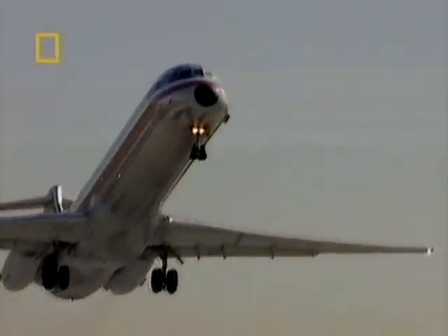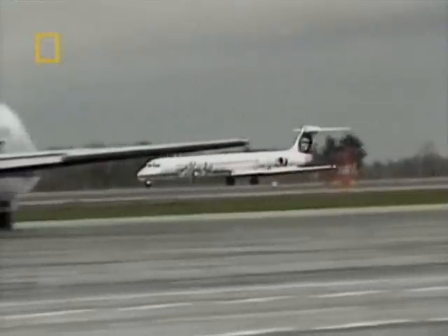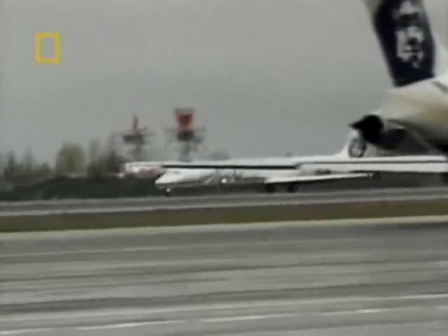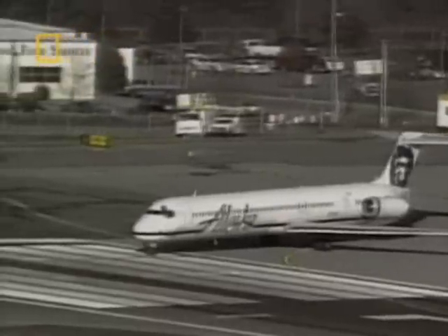They made a shocking discovery. At Alaska Airlines, in six of its fleet of 34 planes, the jack screw assembly needed to be replaced after failing new inspections. No grease — or inadequate grease — is the only thing that can give you that wear rate. No grease is the culprit.